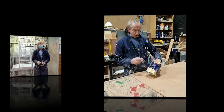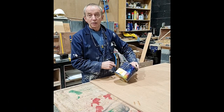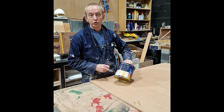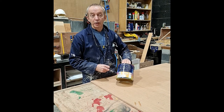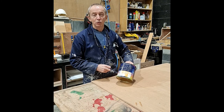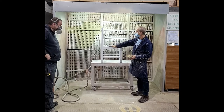The paint that we use is Fleetwood. It's water-based and in most cases it's a satin wood or eggshell finish. We would apply two coats because we spray it on. If you're hand painting this at home, you may need to apply three coats of finished paint.